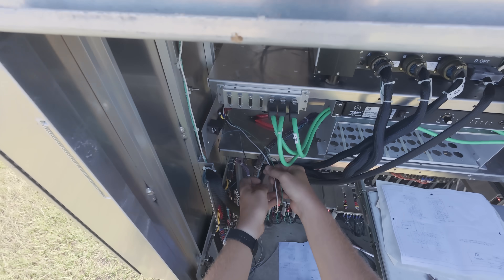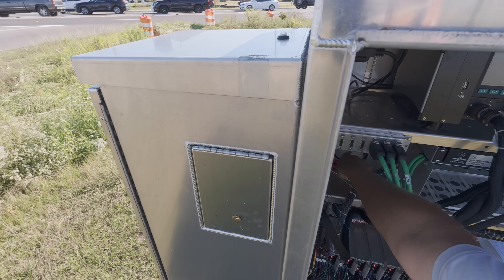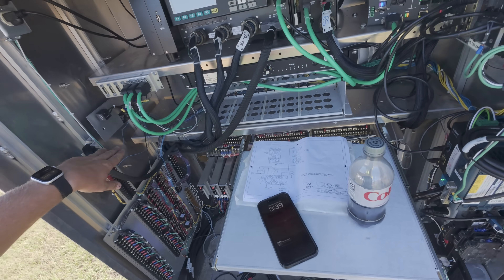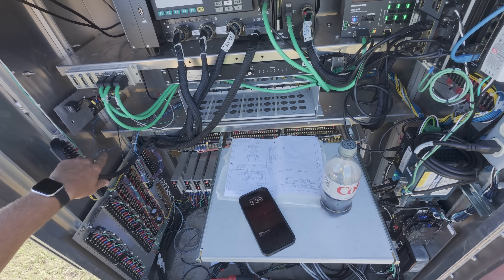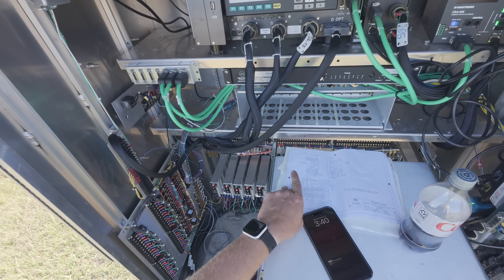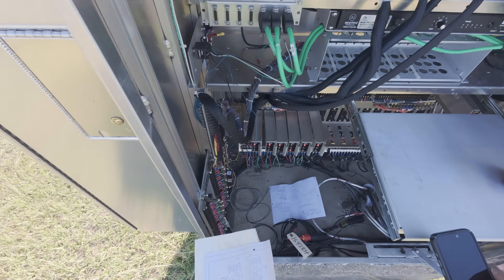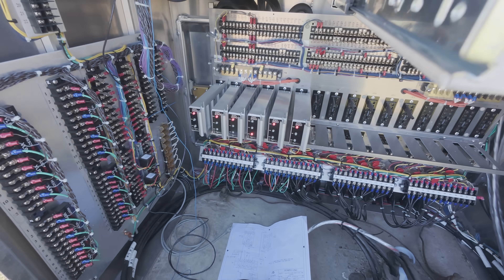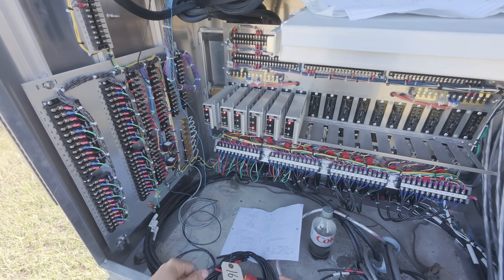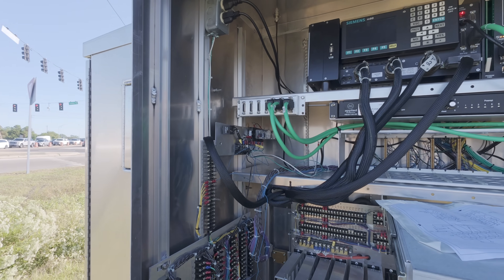Let's try to get my 24-volt cable completely unraveled. Blank-out sign there — that's the future endeavor. That's our logic and our cable for the break of the loop — also a future endeavor. I already hooked up the M11. Next step, we're going to be looking at a 24-volt pin on this backboard, which is going to be that constant 24-volt for the relay that it needs. So let's go ahead and land our hot, neutral, and ground first.